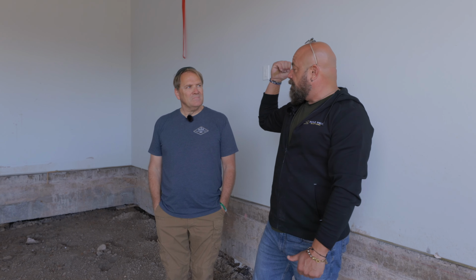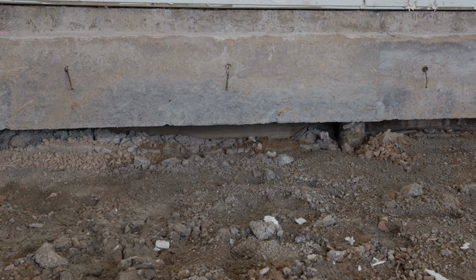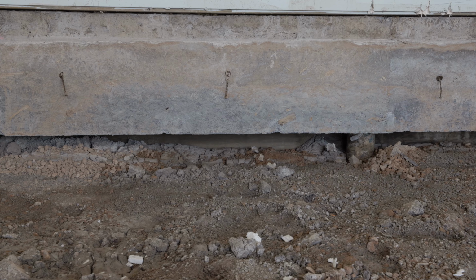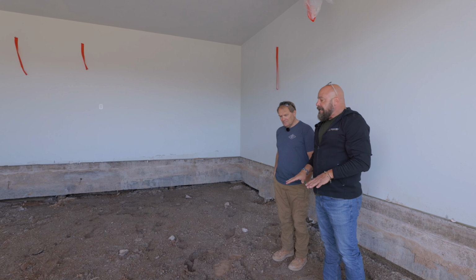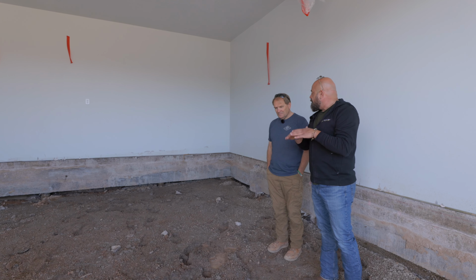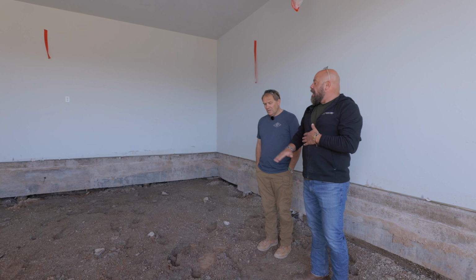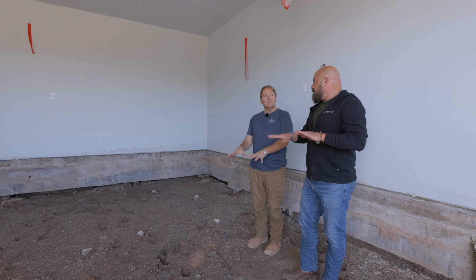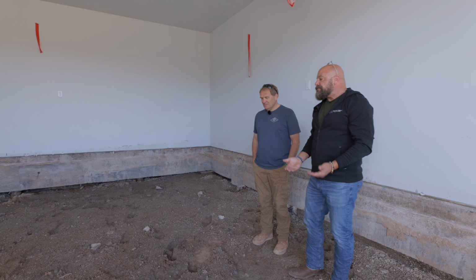So what we're going to do in here is, as we clear out from behind, like we mentioned, we're going to drop in some French drain piping underneath there. We'll actually remove that wood from behind there, and just allow everything to sit on gravel. Now this soil is already saturated, so we know it's not going to raise anymore. It may drop just a little bit as this begins to dry out. This is all expandable right here. It's all expandable. Yeah, this is not a collapsible soil. It's expandable soil. So we know we're expanded up as high as we can.